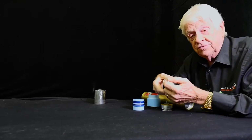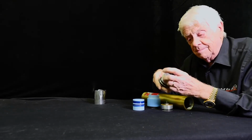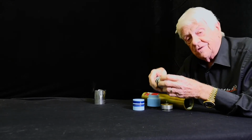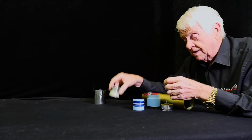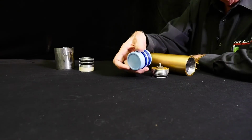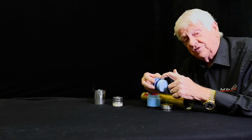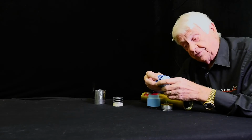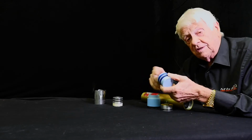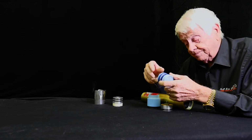It has 2 O-rings and backup rings and a rider ring to keep the heavy metal piston from contacting the cylinder and scratching it. So what we've done basically is we improved the seal arrangement by making a piston out of AeroTough and making the seals out of Thorflex. Now the seals only seal one way. One seal seals the hydraulic fluid, and the other seal seals the nitrogen gas.